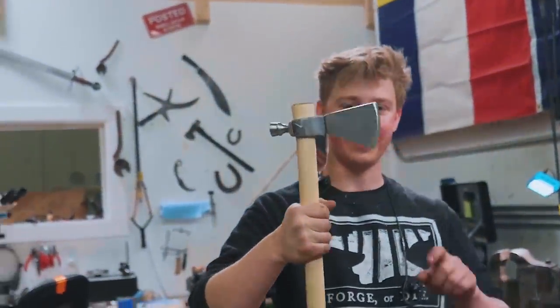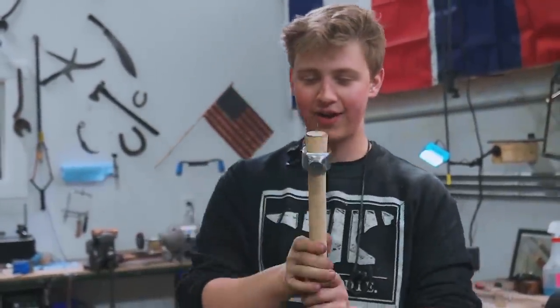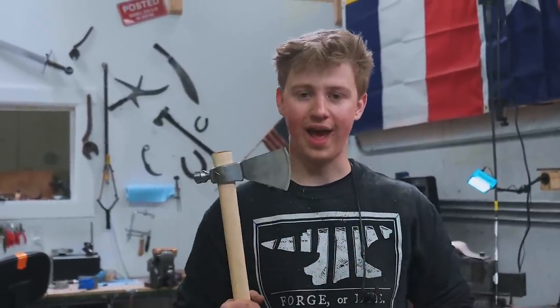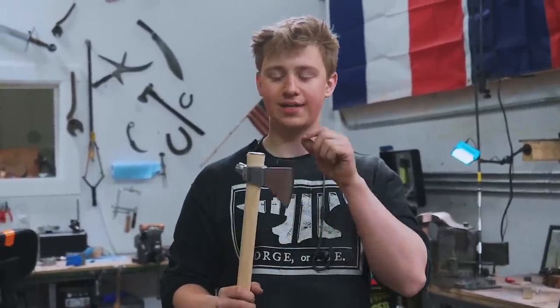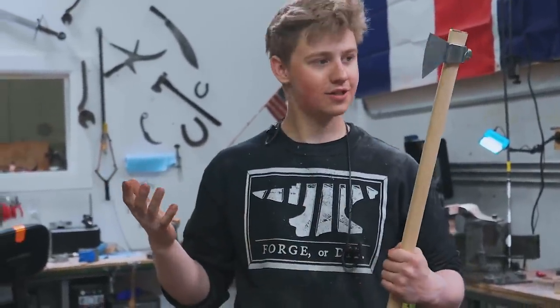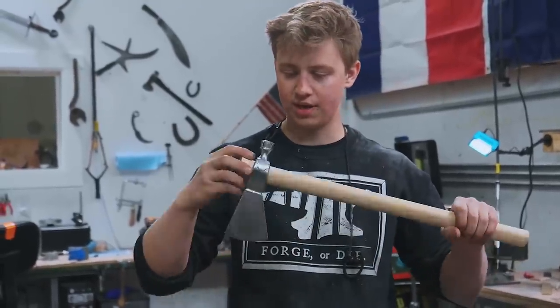We've got a handle on things. Now that we've got it on there, it's still a little bit crooked. That's probably my fault from when I punched and drifted the eye. But I'm going to take a rasp and do a little bit of cheating and get that tweaked over. After that, I'm going to throw the head into the ferric chloride. I'll take it out, scrub off all those oxides, then etch my maker's mark right up top, and then I'll put it into the instant coffee. After it's out of the instant coffee, I'll do the final sharpening and then it'll be done — almost there, a little bit more woodwork before we move on to the etching process.